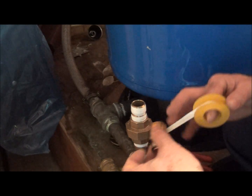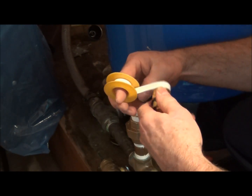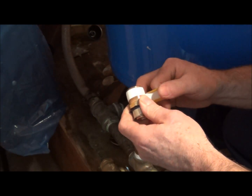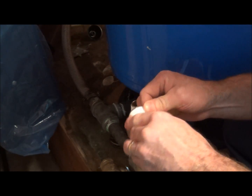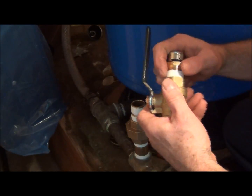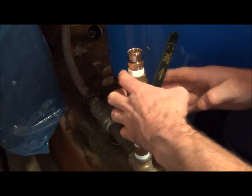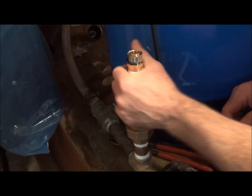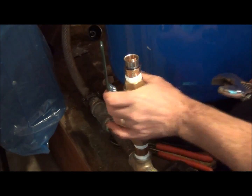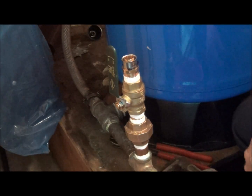So our ground joint. When I say you go into the threads with the Teflon, there's the male adapter. And once you make that first wind around with the Teflon, you have it hooked, and you have the piece that you started with hooked, and you're all set. So that's it. It's as simple as it gets. Famous ball valve. Gotta love it. That union looks like it's a little off center, but anyway.